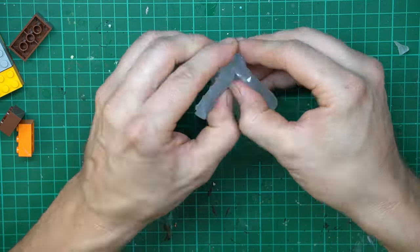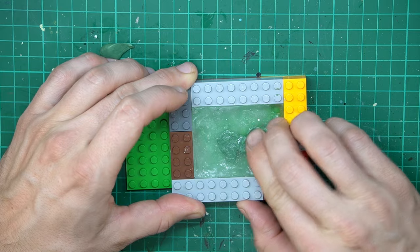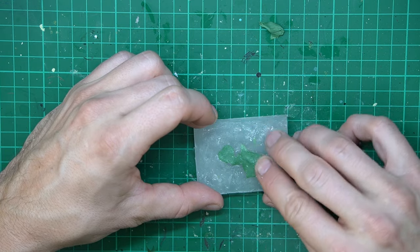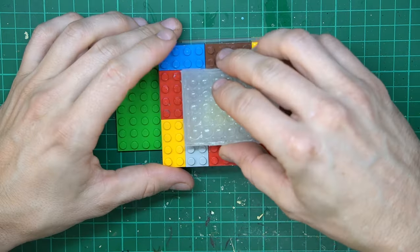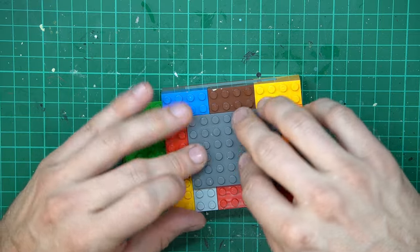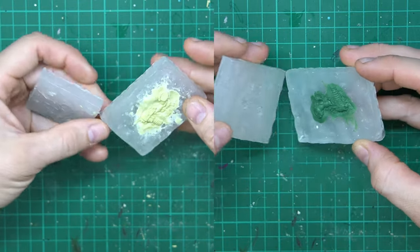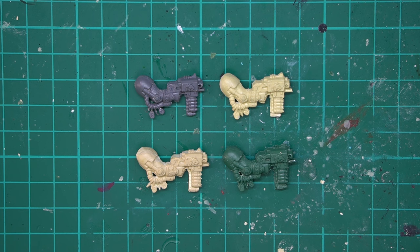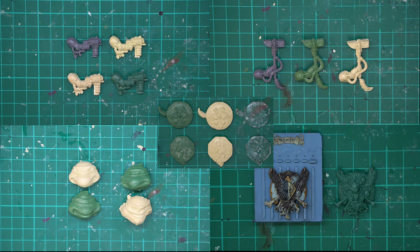Since the two halves kind of melt together again when reheated, you want to make the cooling time as short as possible when doing the double press mold. Here you can see how I had to struggle with a piece that didn't get any extra cooling — I used my hobby knife to get a proper grip on the two parts, but it still took quite an effort to get them separated. Now it's time to add some putty. I'm making a cast with both Milliput and GreenStuff, making sure to get it properly pressed down where the most details are. Using tools to get rid of some excess putty worked great. Use the Lego lid and a clamp to get a good squeeze during the curing process. The result came out great — you can even see my unevenly drilled barrel holes from the original. As no surprise, the Lego method gave the best result, but the other methods worked great as well.